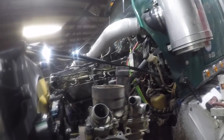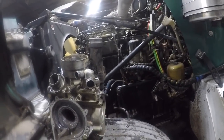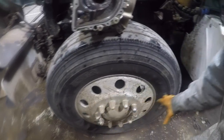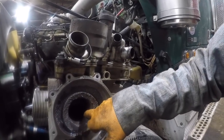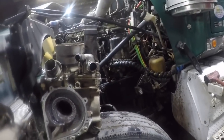Which makes sense, because I used to do a lot of irrigation pipe when I was working for the strawberry nurseries, and all that aluminum pipe, 10-inch, 12-inch main line that we'd set on the ground, with water flowing through that pipe and that pipe sitting on the ground, it would do exactly like this right on the bottom. It would pit the bottom of that aluminum pipe out and get electrolysis in it, and it'd get holes in it from the current, because that water would create a current flow through there. Electrical current.